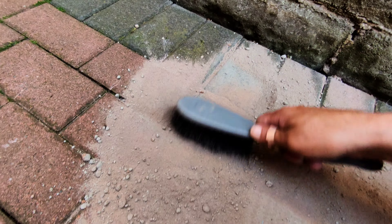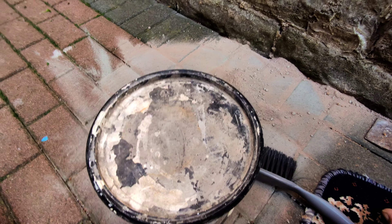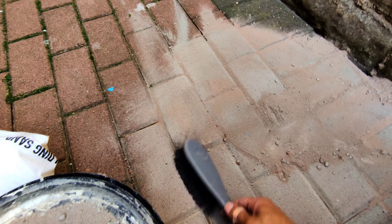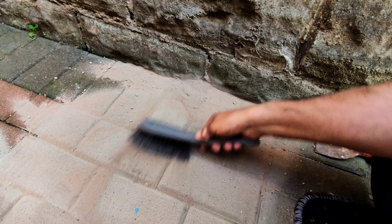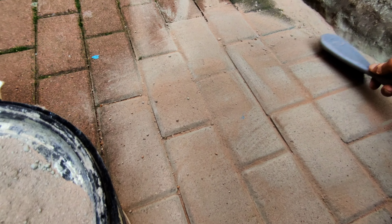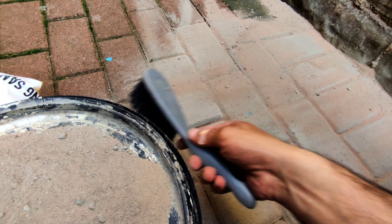This won't be a solid cement mix — it will dry over time in the atmosphere. The moisture in the ground gets drawn up when you put the sand down; it's a basic chemistry situation. You can see I'm just brushing through and filling up the gaps with the sand-cement mix. I've done about twelve bricks in the corner. I'm going to leave the other side with the moss still growing and see how long it takes for this side to stay clear. The moisture in the ground will draw up between these and create a seal.